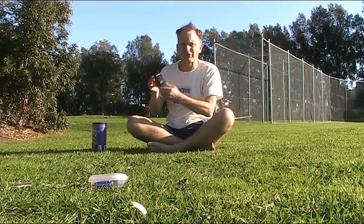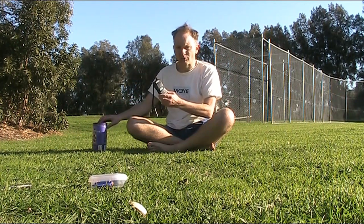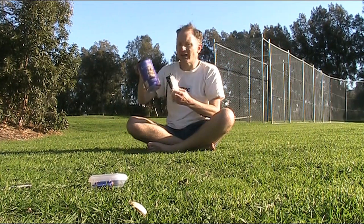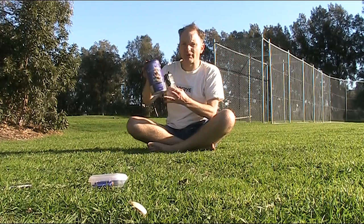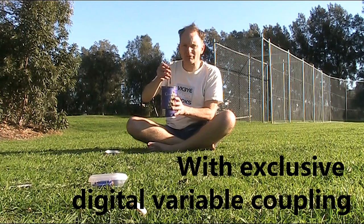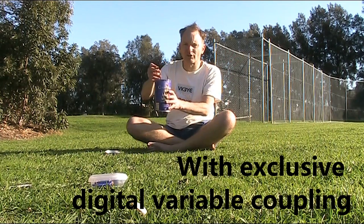The problem is these handheld receivers don't have particularly good RF shielding, and neither do they have an attenuator, so you need to make one yourself. The best form of attenuator is a metal case that completely encloses the transceiver. You also want to introduce a bit of coupling to the antenna when the attenuation is too much. So I present to you this super simple biscuit tin attenuator. Drop your Baofeng into one and you'll be able to track down signals really close to the transmitter.